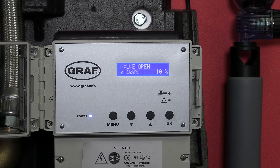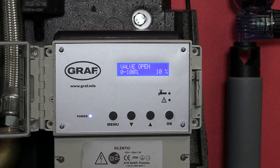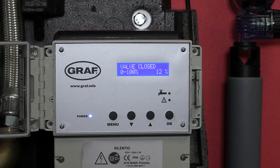That's referring to the red three-way valve. When we get to 10% in the underground tank, the red three-way valve will move into the mains water position and take water from the mains water reservoir behind the pump. Then, following some rain, if the level builds up to 12% in the underground tank, it will close the three-way valve, opening up the rainwater pipework to allow the pump to draw water from the underground tank.